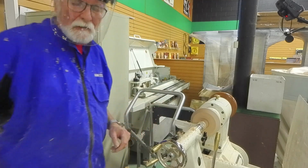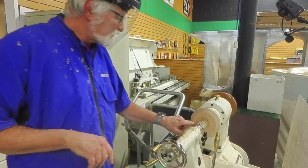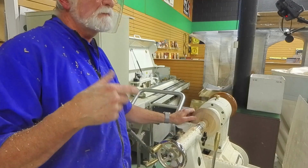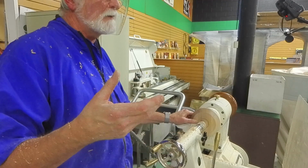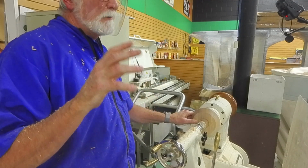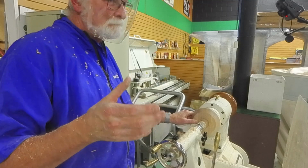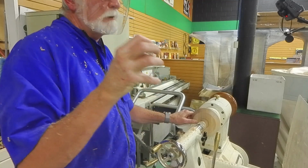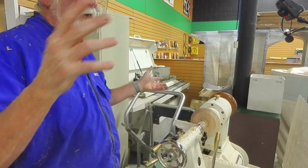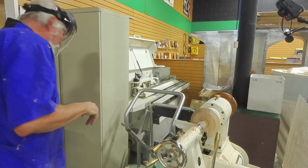If you're doing a narrower piece and you're using a mortise like this, the reason I use a mortise and not a tenon is for the wood I use, which is birch and Manitoba maple and poplar. They're not all that hard, and I found a mortise works better than a tenon. I find grip tenons just rip out of whatever I'm doing. And maybe I make them wrong, I don't know. But I've found that mortises work better.